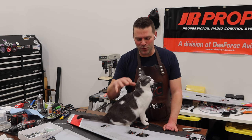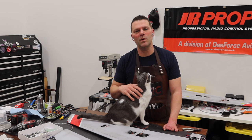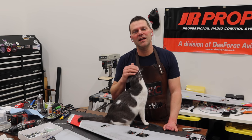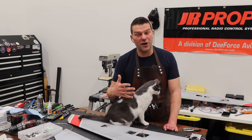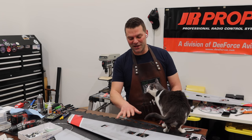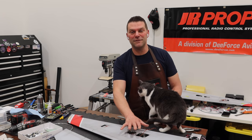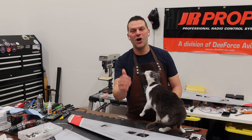So I was going to finish both of these wings together, but I think what I'm going to do is wrap up the left wing, get it all completed. And then finish up the right wing, just because I'm on a bit of a roll today with this wing. Next thing we have to do is work on getting the flap servo and the flap mechanism all set up.